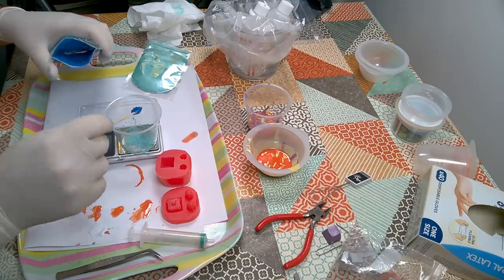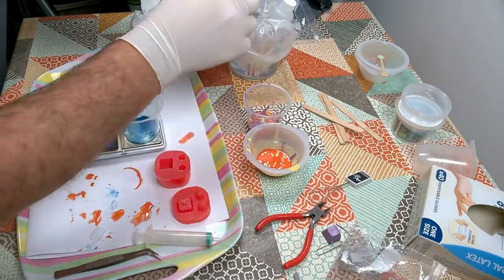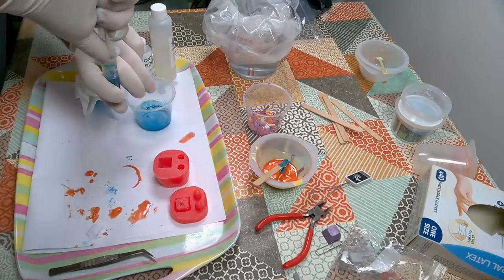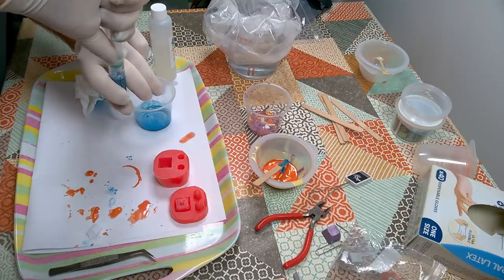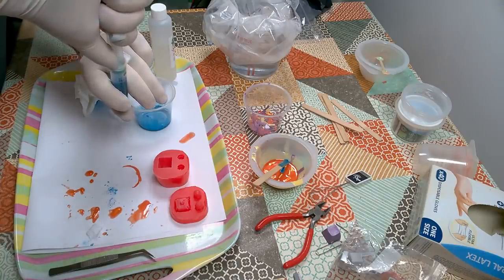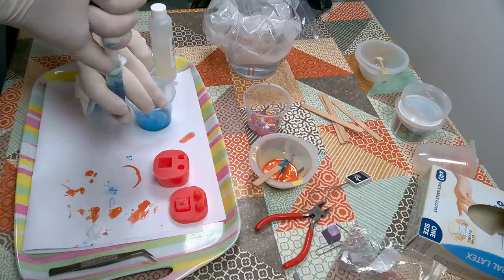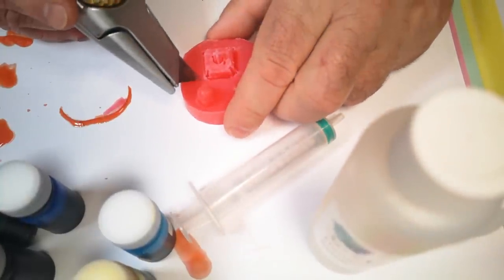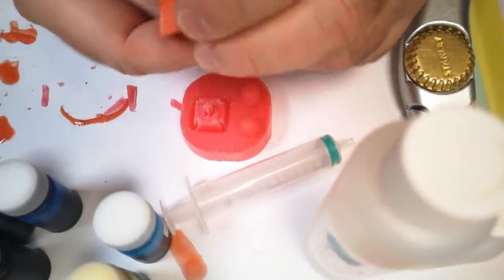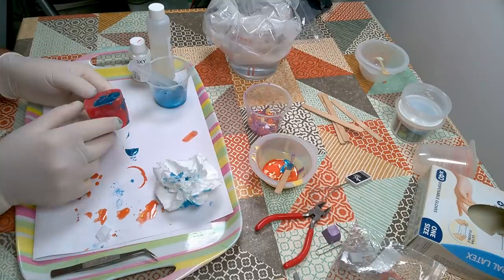I ordered some different pigment powders, so I wouldn't need any separate dyes. Heating the resin in a water bath also helps, because it reduces the viscosity of the resin even further. And I figured out that after mixing the resin and tapping the mix container on a hard surface to expel some of the bubbles, I can sort of degas it a little bit by placing my finger over the end of the syringe and retracting the plunger — this creates a partial vacuum. The bubbles that are in suspension grow bigger, and this allows them to float up to the top more easily. Not perfect, but might be good enough. I also figured that if I cut away some strips in the top part of the mould, this will give any remaining bubbles somewhere to go that isn't part of the final keycap. Once again, I partly filled the mould, mated the two halves and injected the resin, leaving some extra on top of the sprue holes to drain back down inside.